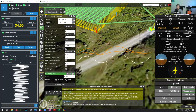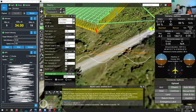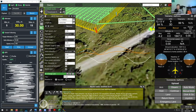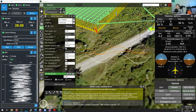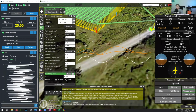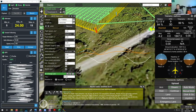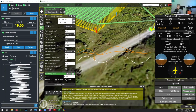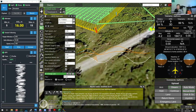And second way is you can set it to relative, and this means that you can set a certain percentage of the measured altitude that it will use for the hysteresis. But in any case, the end result is that it will not move as much and will be flying over rugged terrain, or especially if there are some bushes here, then that might help. Of course, keep in mind that you do need to maintain a safe altitude above ground.